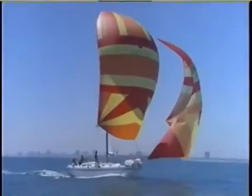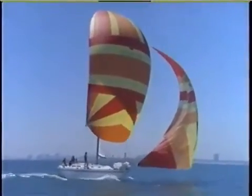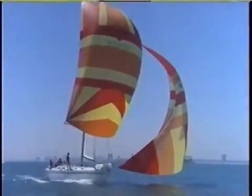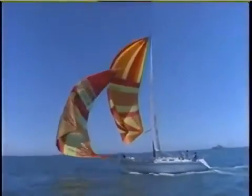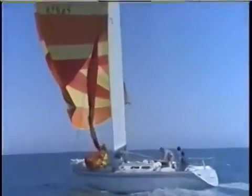When it's really blowing hard, however, common sense says that adding sail area isn't really the right answer. If it's so windy you're choking down the sheet and the pole, you have a preventer on your boom, and the crew is aft, holding the stern in the water, you don't really want a blooper. It exposes too much area, and when the boat does roll out of control, you'll be lucky to recover the luff tapes. The number 4 Genoa, or a small jib set inside the chute and trimmed hard amidships, is the right answer on a screaming run.